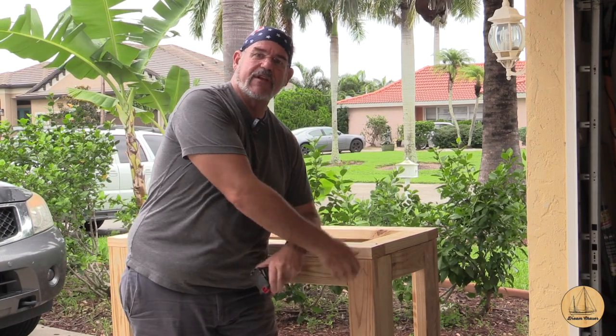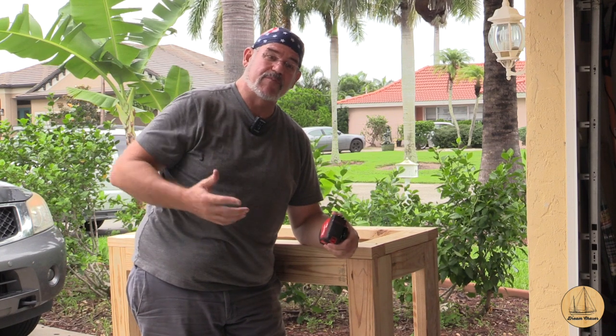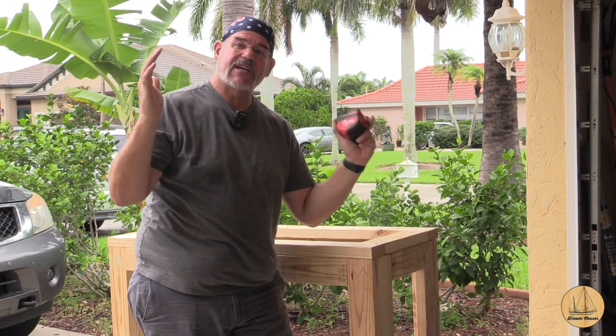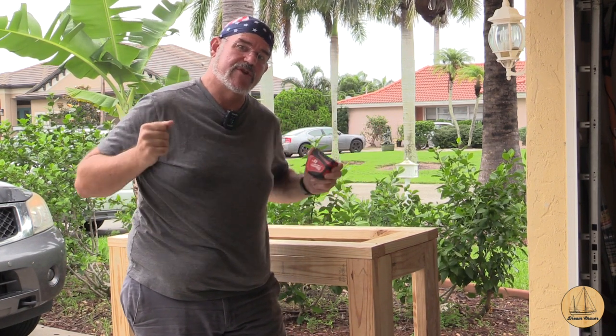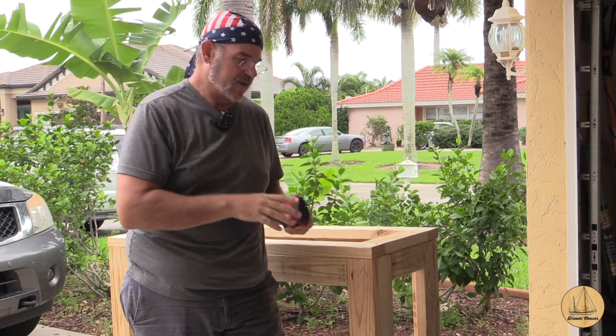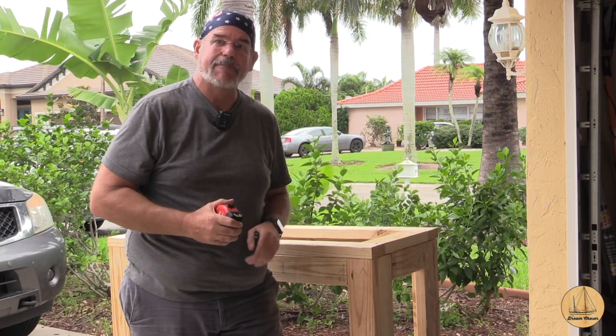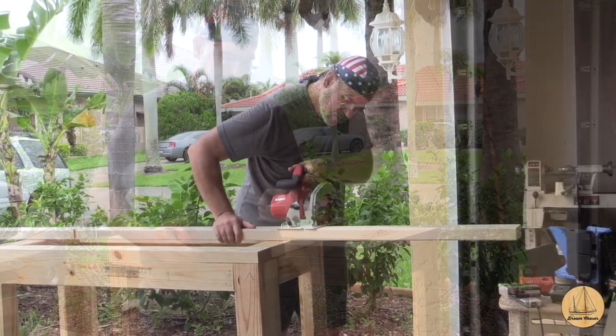So 26 inches in height will be perfect to fit between the lower support and the upper support, and I'll attach those with pocket screws. That'll make the outside edges of the frame for where the door panel will go on. That'll be nice because once it fits in there nice and tight, then I can run screws through the stainless steel door frame into those pocket beams I'm putting up.